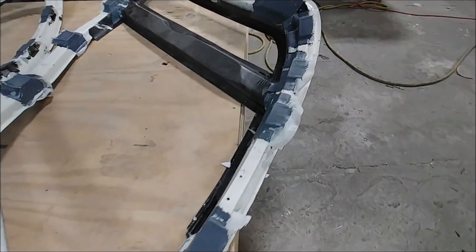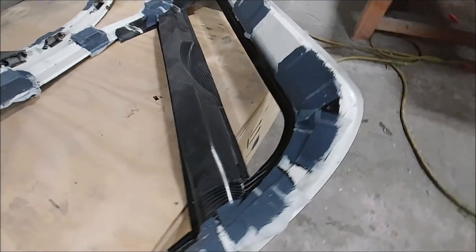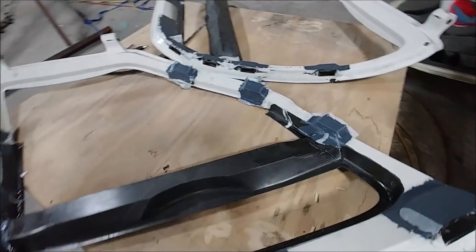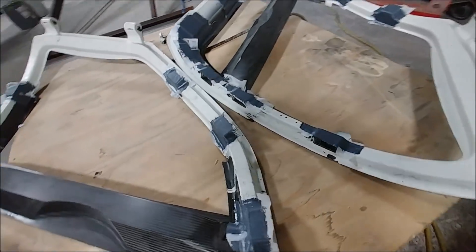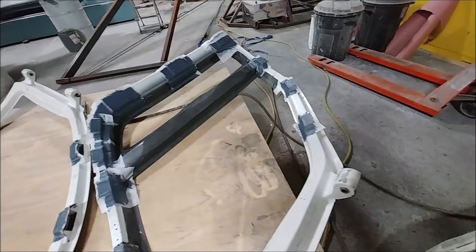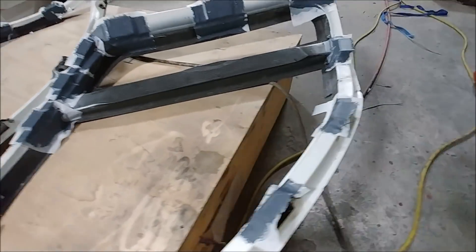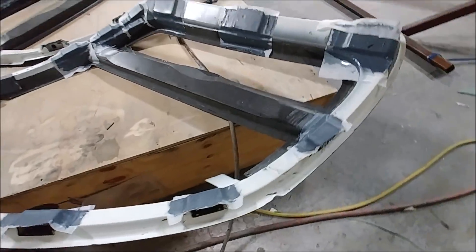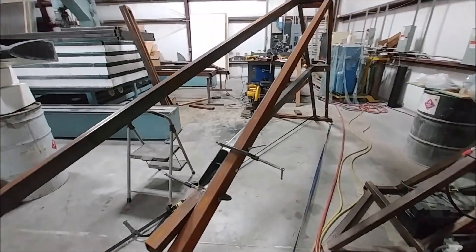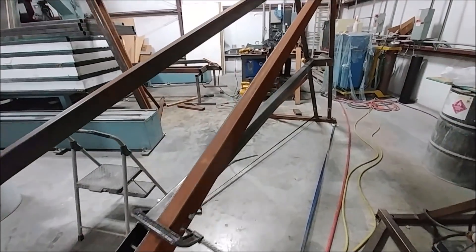While I was up at Brit's, Devin got the little layups — just a single ply — laid up over the top of those door locks to neaten them out where the FR4 had been bonded in place. They just need the peel ply taken off once they're all set up, cleaned up, and then that door can be ready to be reprimed.